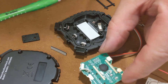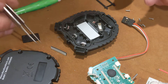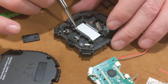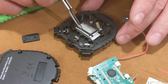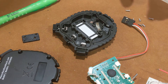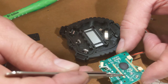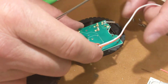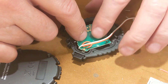I've got my wires attached onto this board, so now I'm gonna put this whole assembly back together. I'll start with these conductive strips for the LCD — one of them was stuck to it, the other one dropped off. This is a guide that keeps the conductive strips in the right orientation. And here's where they're gonna conduct onto. I just have to flip this over — there are some pins that locate it, kind of like that right there.